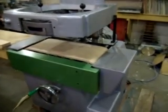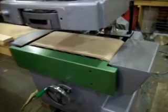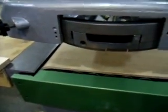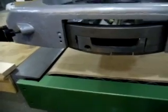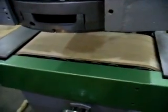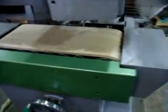So the basic setup on the Supersurfacer, on the top cutting one, is the feed belt is on the bottom. That consists of a power feed roller, an idle roller on this end, and 5 pressure rollers in the middle, and a heavy feed belt.